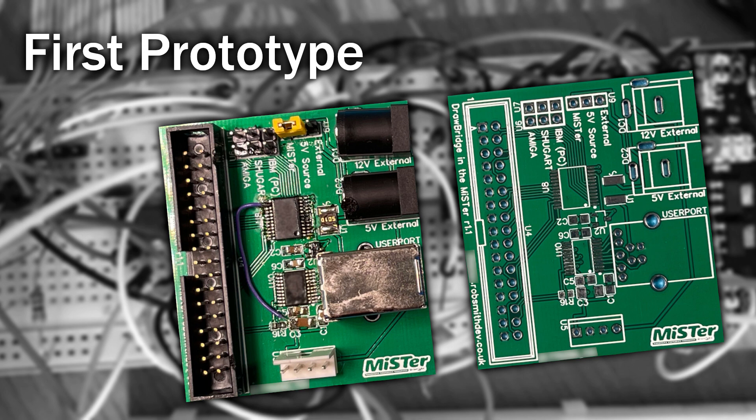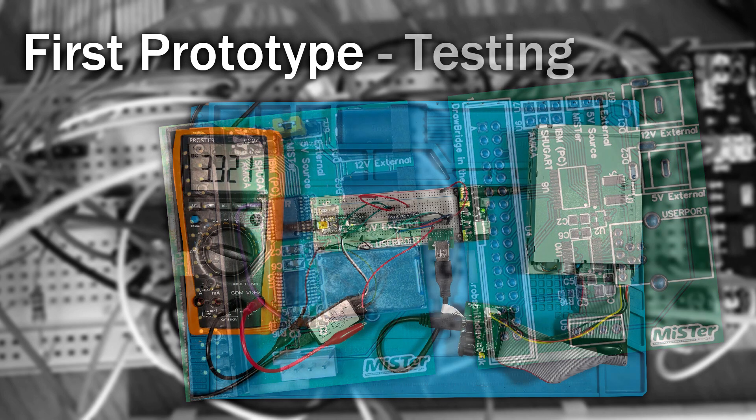This is revision 1, and I already have a revision 2 design that isn't compatible with this board. I'm not yet ready to share the details of how this board works, mainly because I don't want anyone to build this until I'm 100% sure on the design. But safe to say, all the time-critical connections like reading data connect directly to one of the IO pins on the user port. There's a massive shortage of everything right now, and you can't even get a replacement DE10 Nano, so I'm not about to plug this into my MiSTer without confidence it won't blow it up — so I've made a bit of a test rig.